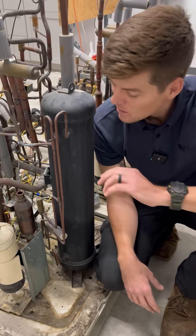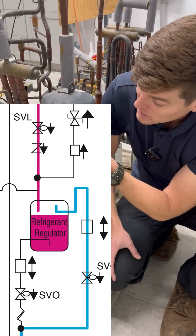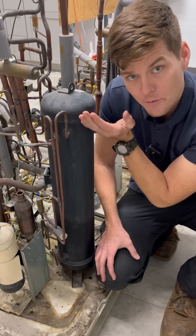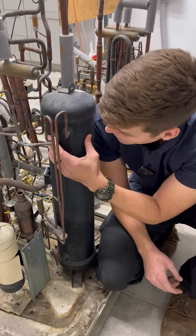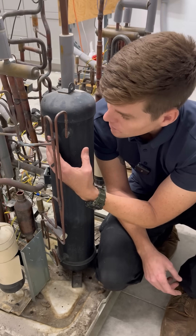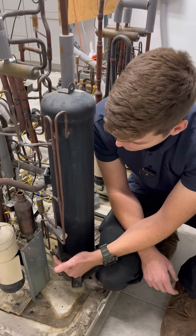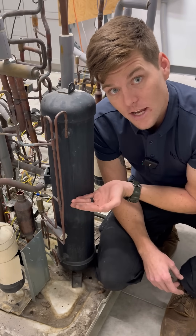Here is the beauty of it and how it works. With VRV3 we had the ability to purge the top of the tank — this is the top of the tank — you would purge the gas out down into the suction line, removing any vapor at the top of the tank while you also stack liquid right here at the top as well. On one side, the right hand side, you come up, go over, and you actually stack liquid here in the actual tank. It would trickle in on the top, the solenoid at the bottom would be closed, we'd purge the vapor off the top, and the liquid would stack up at the bottom of this tank.